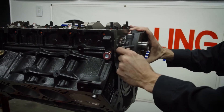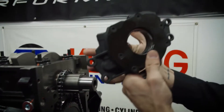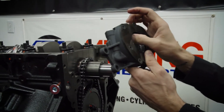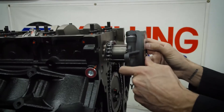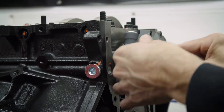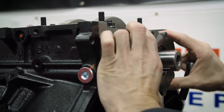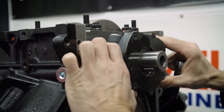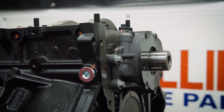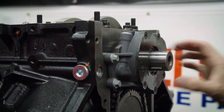So we're just lining up — this is keyed in a sense, and this is as well. There's no one specific point that will only work, they're all equally distanced. It's snug there, and there's a tiny bit of wiggle room here that I'm working with, because that oversized bolt holds there. What we want to do is make sure that gear is pretty well concentric and centered to that gear — both gears are meshing up.